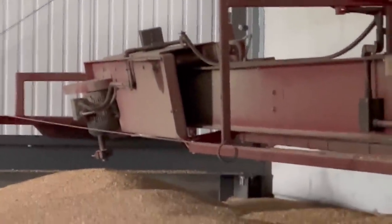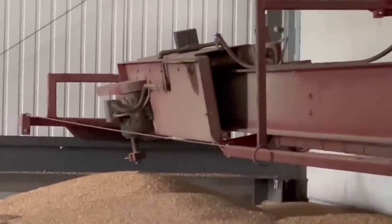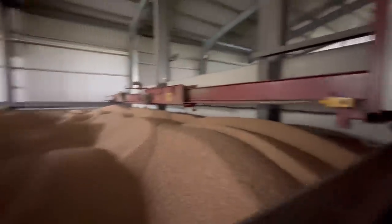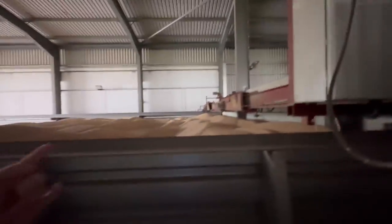I just caught that end with the grain pusher a few days ago and you can see that's not looking quite right. Not a big job — we just need to wind that forward and wind the whole beam forward. I can just move that, go up with the cage and put that onto the runners. Then the stirrer — all the electric wires run on there — there's a wire that goes right through and runs on the rollers. That grips on top of the runner and drives all the way to the shed. We put a stopper there where we don't want it to go further, and then you can set it to auto so the minute it hits that stop it just comes back this way.